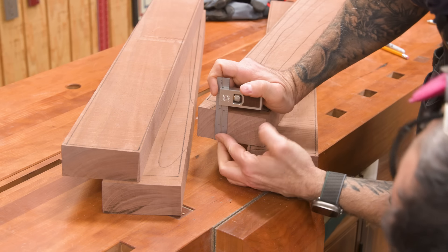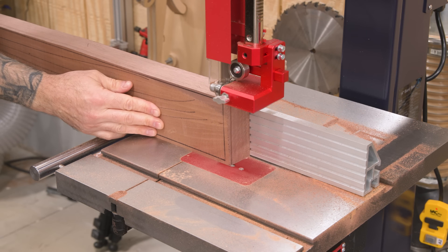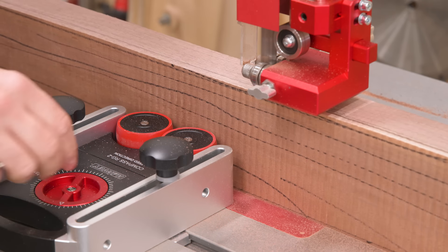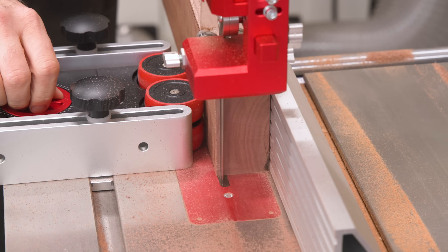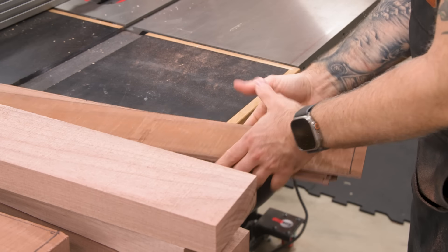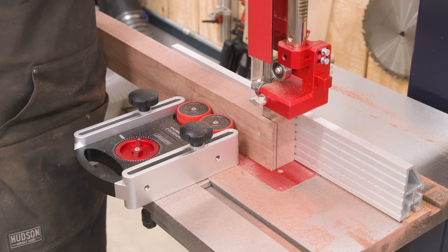The stock here is pretty thick and one of the mistakes I've made in the past is not letting go of that thickness. Walnut is expensive and I have it, so why not use it? But leaving pieces too thick can make a design look clunky and also makes the furniture needlessly heavy. So I'm resawing the boards down to a more visually appropriate thickness for the scale of the piece. I can reserve the thin slices for another project in the future. The rails get the same treatment.